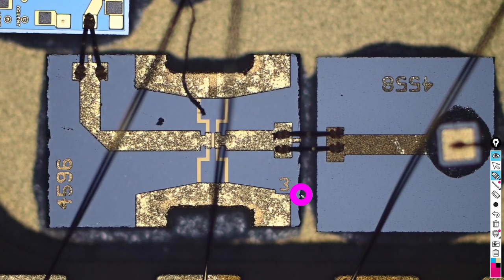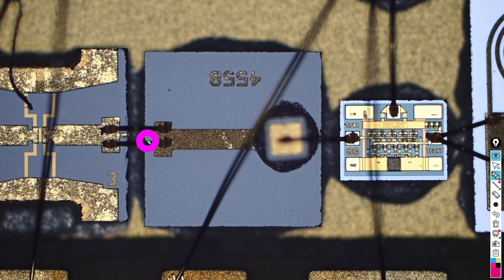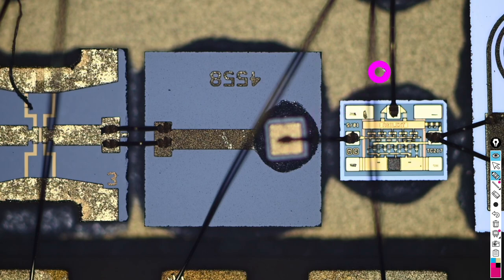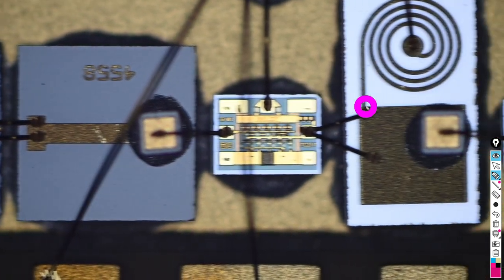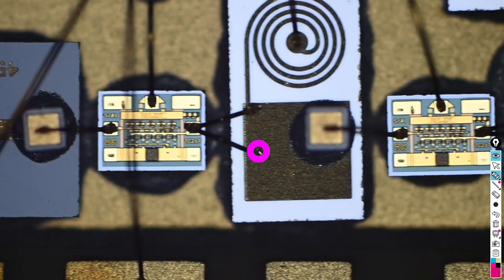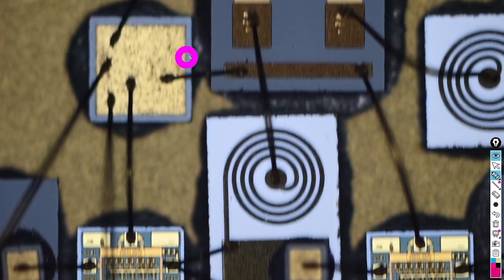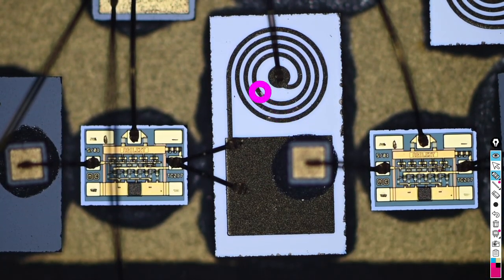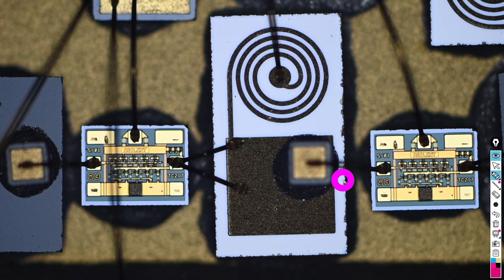Going a little further, we have a component which is actually just a decoupling capacitor. The signal comes in, goes through the decoupling capacitor — it has some height so it's a bit out of focus — and the top of it is wire-bonded to the next stage. This allows us to completely isolate the next stage. Then we have our first amplifier, again a part made by Agilent. After that part we have a biasing inductor on ceramic — basically a bias T. They're putting the bias through here and the signal is AC coupled to the next stage.